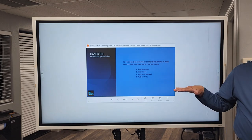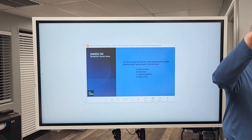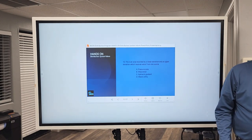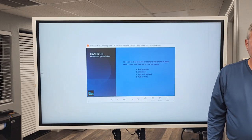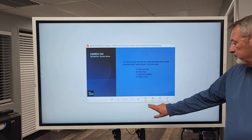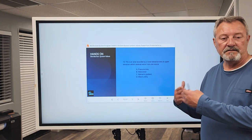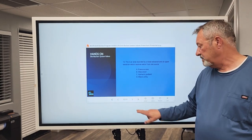So if we drop below 85 PSI, let's say we go to 70, the customers at the higher elevation might only be getting 30, 35 PSI. That's going to cause complaints. It's going to make people unhappy. I personally don't want 35 PSI at my residence. So that's a pressure zone. And that PRV, a pressure reducing valve, is what allows us to isolate off a pressure zone or determine where that pressure zone is.